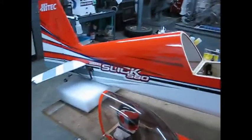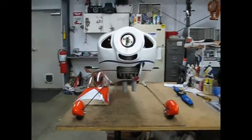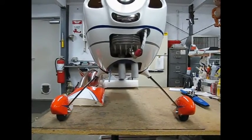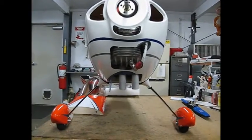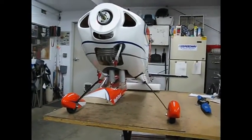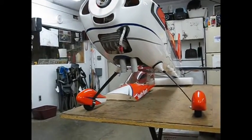The instruction book was pretty lacking. I'll get down here where I had the biggest challenge, which was cutting out the cowling. Nobody wants to open their cowling up any more than they have to, and poke that little DA-50 out — because the book showed a picture of a 91-inch extra with what looked like a DA-60 hanging out of it. So the picture in the book was absolutely no help. I'll flip the plane on its back and get you some better shots of that, for anybody that's interested in hanging a DA-50 in one of these — with a pits pipe, for that matter.